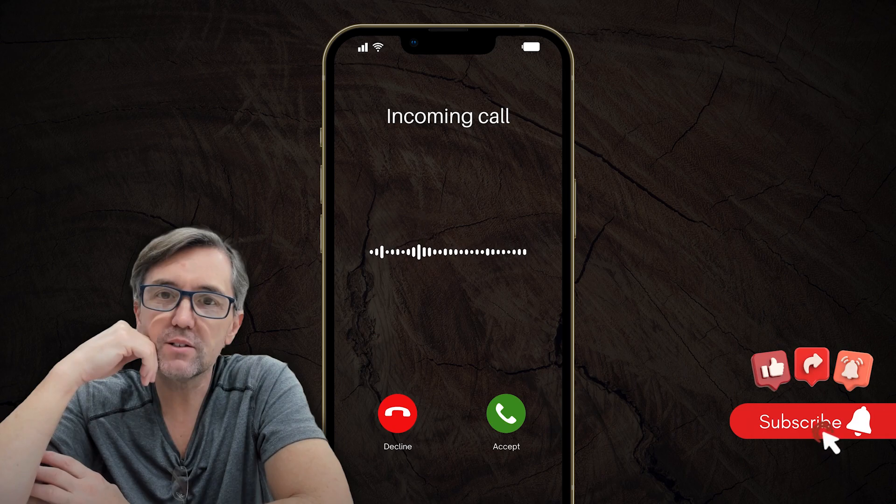That's what I would recommend. Because it's inch and three-eighths, you've got to be three and a half. A four-inch hinge is too wide. Four and a half is too wide. If you've got an inch and three-quarter thick door, you can put a three and a half on there, but it's not the right size. Generally, if it's commercial it's four and a half; if it's residential, it'd be four-inch. This is just something you need to memorize.